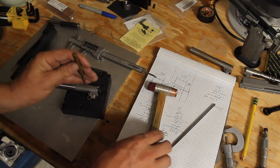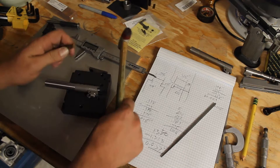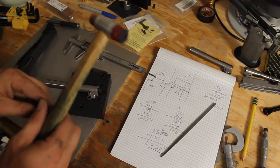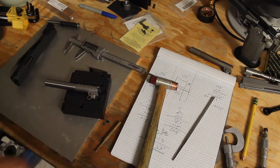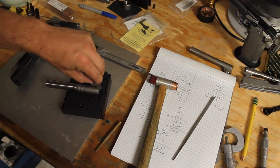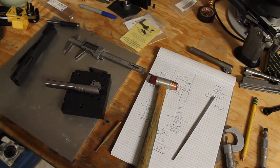This link pin is a press-fit pin, and I absolutely hate driving this pin in — getting it started is just terrible. Sometimes these pins want to go in and out only one way — that one's got a direction to it. After struggling with it I ended up putting it in my mill vise and squeezing it in, and we'll come back when I've got it out.